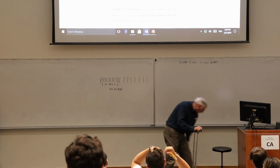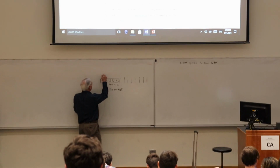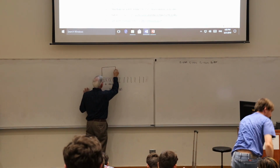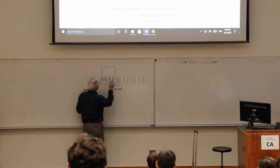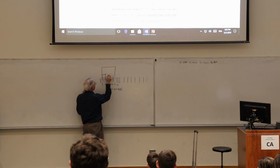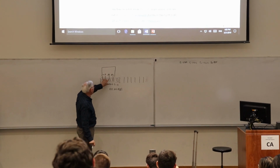But it's there. When you plug in the little board, I forget which way it faces, but the little board covers 4 of these pins. The 5th pin's not covered, I think. There's 4 pins that plug in, and they should be labeled negative, plus, and then the 2 analog channels. Make sure you get those set up correctly.